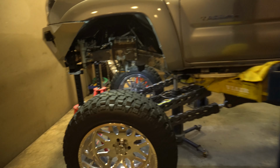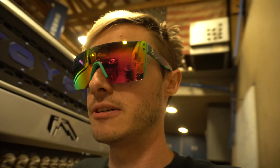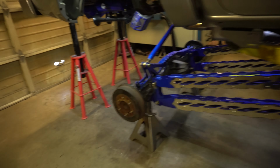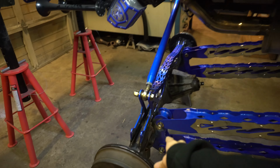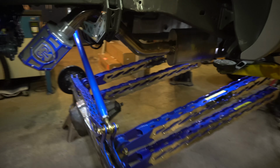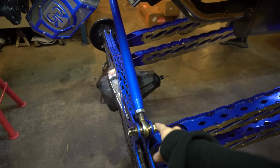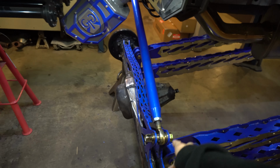Awesome day working on Gigantor, guys. We did really good. I'm stoked about it. So we started out today, we got the rear axle four link mounts welded on, fully burned into it. There, look. And then we got the axle back in place with the rear arms on. Now we're ready to measure and make our new panhard bar, because you can see how that's way too threaded out there, look.